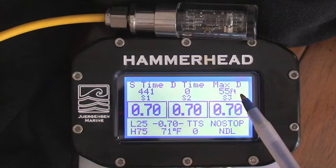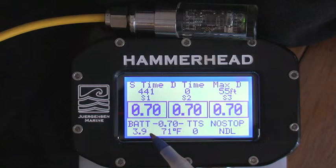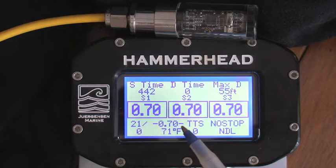Below the oxygen sensor displays, there lies a group of information which will toggle continuously, giving the diver a stream of reminders during diving and surface operation. The unit will toggle between current battery voltage, then to the fraction of oxygen and helium component of the diluent gas currently selected, and finally, the current gradient factor setting the unit is using to calculate decompression. These three pieces of information are considered vitally important, which is why they are displayed in an active fashion.